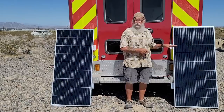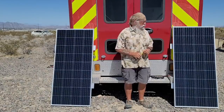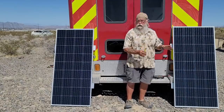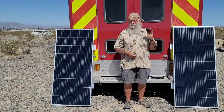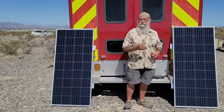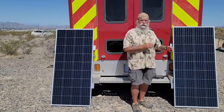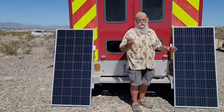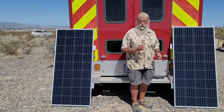First, let me measure them for you. The first thing you do when you're thinking about buying a panel is make sure you have room on your roof for that panel. That's number one — measure. Climb up on the roof, look around, where will this fit? If I'm going to order two, where will two fit? Three, four or more — where is each one going to fit? That's why you have to have a tape measure. The very first thing you do when considering any solar panel is find the dimensions and fit it to your roof first.